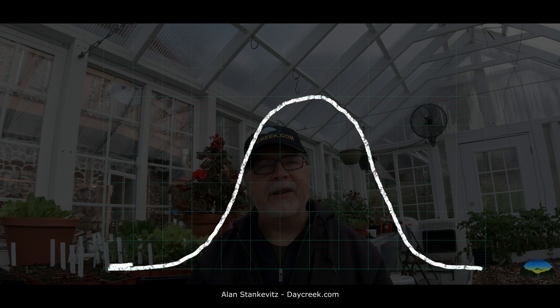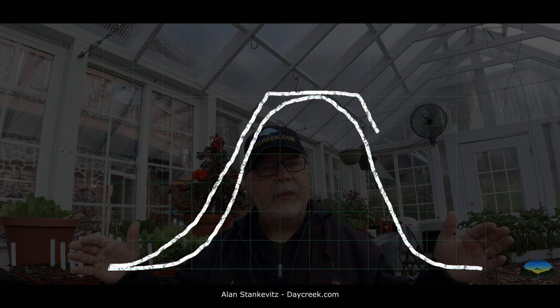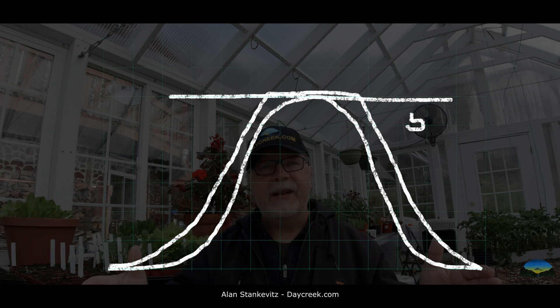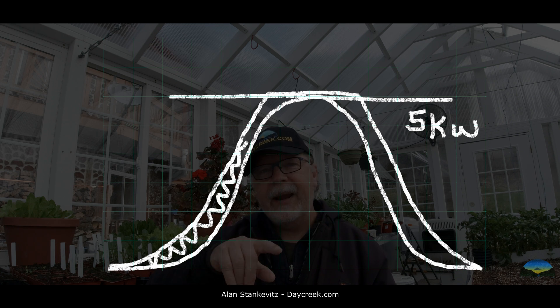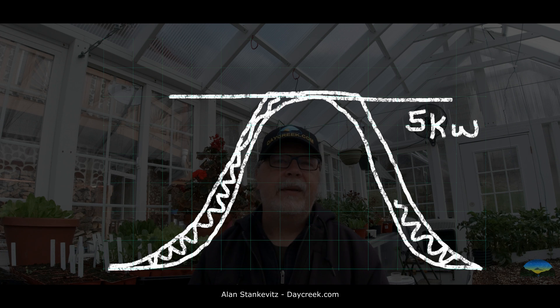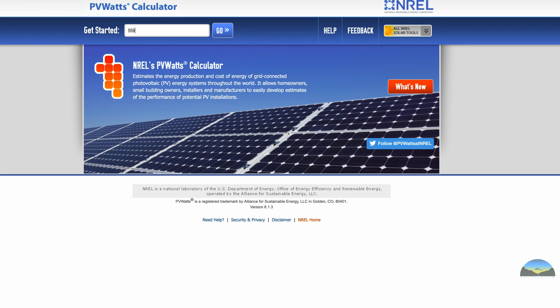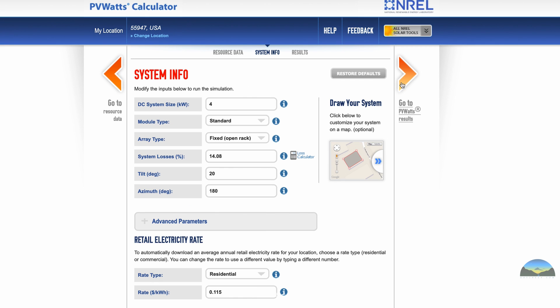The second thing is that because you've added more solar panels, you're making more watts in the morning and afternoon before it clips. And even when it is clipping, that flat line you're getting is consistent — many many hours of 5 kilowatts — versus if I only had a 5-kilowatt array, it would only peak up at the top. So I got on the computer and used a program called PVWatts. PVWatts is a program developed by the NREL, the National Renewable Energy Lab, used here in the United States to accurately calculate on an annual basis what you might obtain as far as solar output.